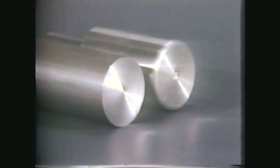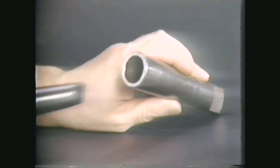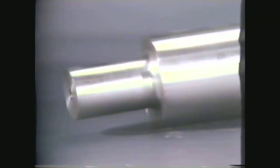The reasons why you would machine a radius on a workpiece are to reduce safety hazards of sharp edges, making it easier to assemble close-fitting parts, providing a decorative finish to a workpiece, or simplifying problems of heat treatments.